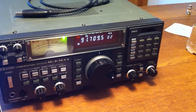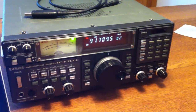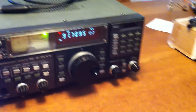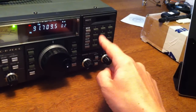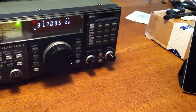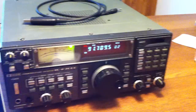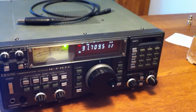This is an old radio — it's from the 80s — but it works really well. You can find them fairly cheap on eBay. One common issue is that the keypad where you enter frequencies is a bit bouncy, so if you press a digit you get more than just the one digit you pressed. One way around this is getting a CI-V control cable and controlling the radio through the computer — then you don't even have to use the keyboard anymore.